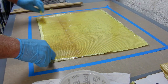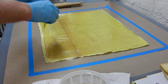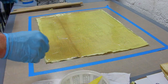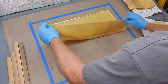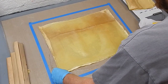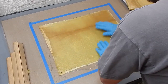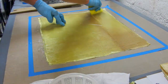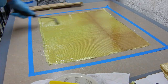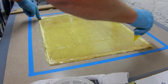It's more for demonstration purposes, to get a sense of how the material handles, and also to show how you can do wet layup on a honeycomb in one shot. This is only a 6-ounce piece of Kevlar, and when you handle it you'll feel that it's much more substantial than a 6-ounce e-glass or even carbon — it feels really thick, more like a 9- or 10-ounce material. Because Kevlar is lower density, it just takes more Kevlar, so it's thicker. I'm wetting out the second ply — what's going to be the ply for the top skin.